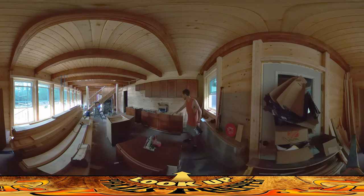The first step is getting them onto the floor and making sure they're the same height as these other cabinets, because there's going to be a contiguous countertop going all over the entire area. Even if you get these nice and level, if they're higher than the ones over here you're going to have a weird transition area. I've been using a nice long four-foot level to get a run from here to here. It's not absolutely perfect but it'll be close enough — there's going to be a bead of silicone and a little bit of play in there.